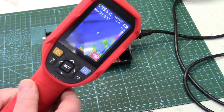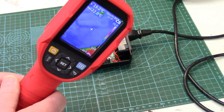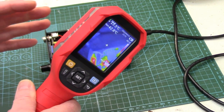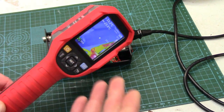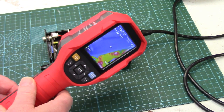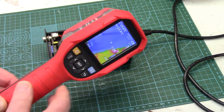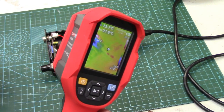Every now and then you'll hear it click and the image will freeze momentarily — that's just the flat field correction shutter firing. It's a little mechanical shutter that apparently closes in front of the sensor chip so it can do a calibration. It does it more often when you first turn it on while the imaging chip is warming up, and less frequently once it's warmed up. That's probably also why the manual states right off the bat that you shouldn't be cycling the power on and off — you'll get your most accurate readings after it's been on for a few minutes. The less you turn it on and off, the less that shutter fires and the longer it's going to last.